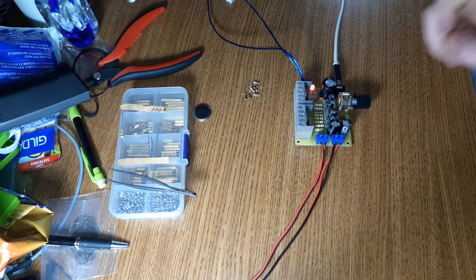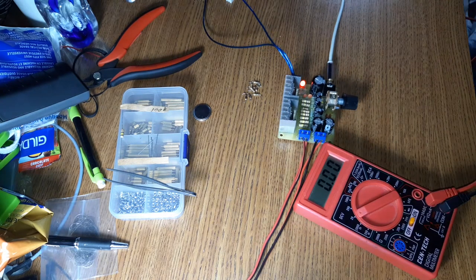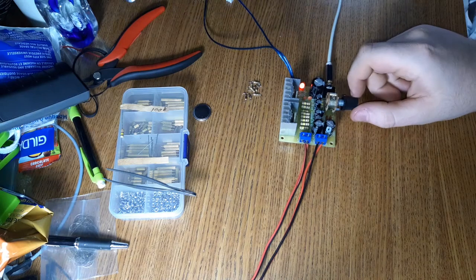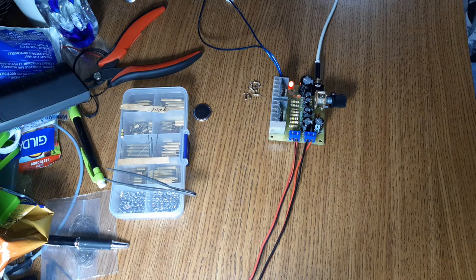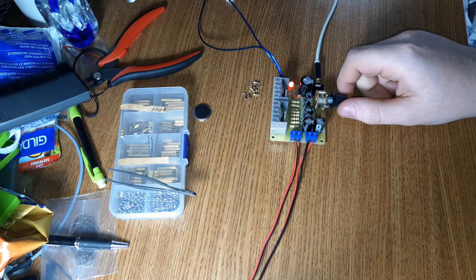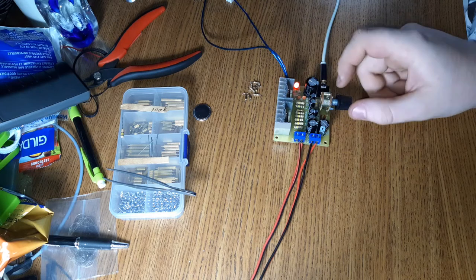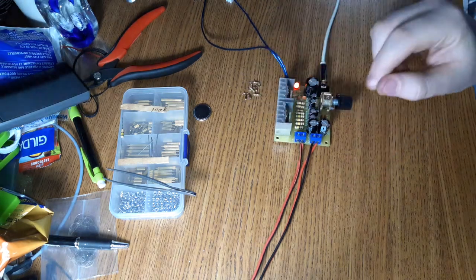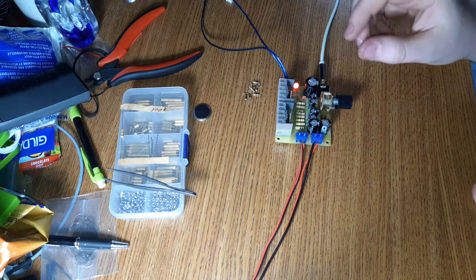It's getting pretty loud with not a lot of power — just goes to prove that wattage does not equal loud. We're on 15 volts, real bass-heavy. Actually clips pretty good. Let's go ahead and crank the power supply to max — about 19–20 volts. That gives a pretty good little kick for only four or five watts, maybe six. I'll pull out the dummy load and the oscilloscope and see what it's really putting out.